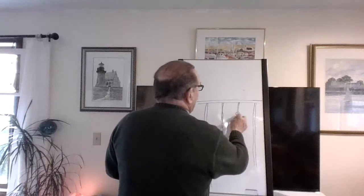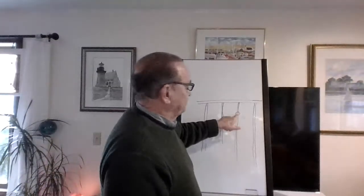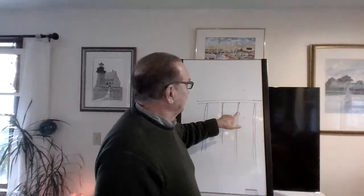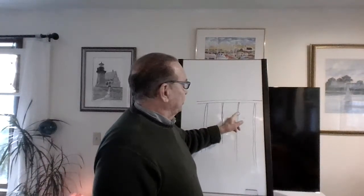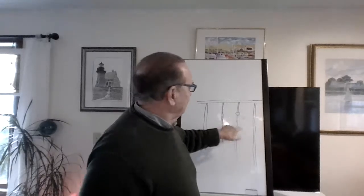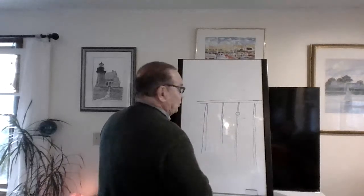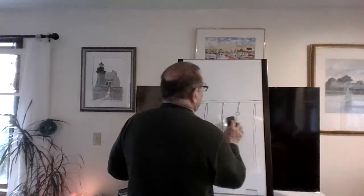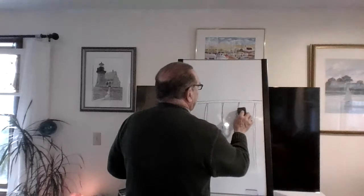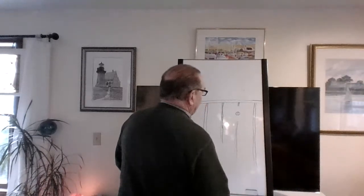What I suggest is cut out what you absolutely have to. Like put a Street 45 up into this plan. I put a Street 45 into that flange. So that you have to, but you still have to hollow out maybe a third to a half of this to do that. Now, let's say that you do what the contractor told you. He'll say, go a foot on either side. So you do. You just Sawzall it out of the way.